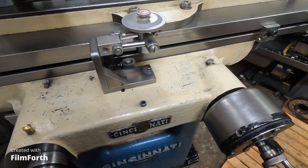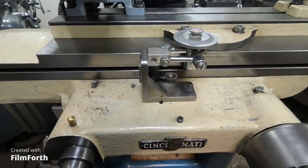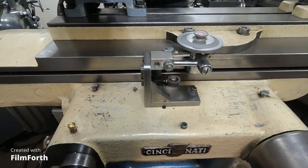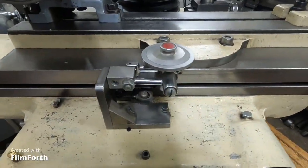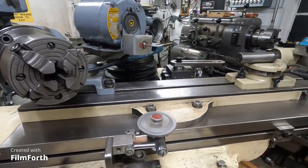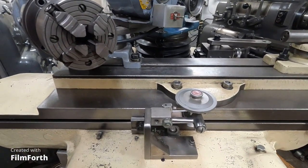Okay, well, you can take this, push this in, and then load against this, see? Put a little bit of load. Usually these have springs in it. These things are missing. These are quick homemade things that are still on there. But you can load this, then the table's locked, solidly locked, and that way you can do cutoff. Locking the table any other way is not going to do it. It'll still jiggle back and forth.